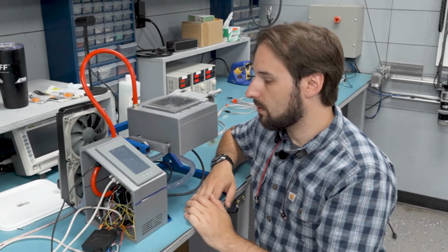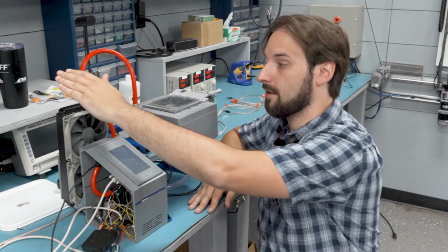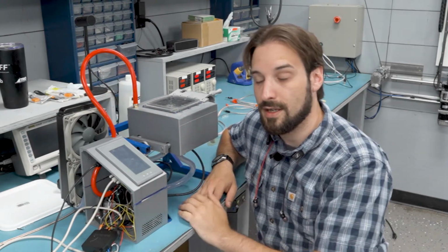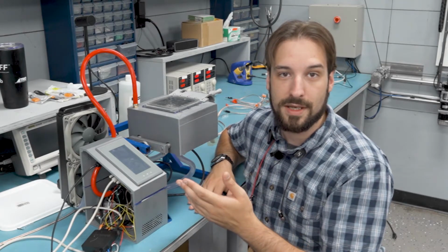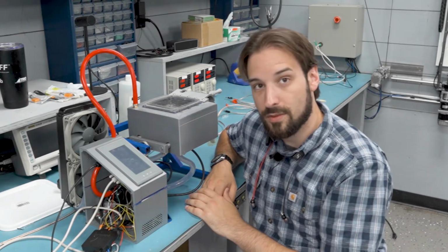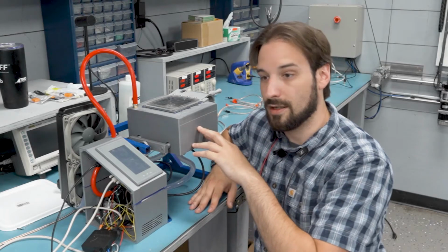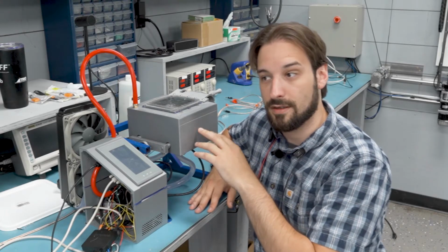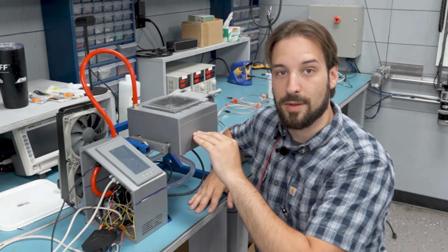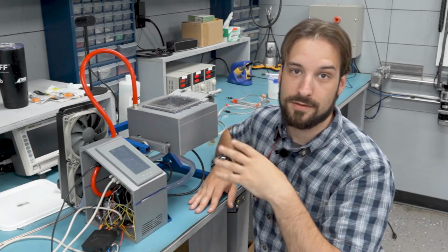So I have this wired up so that as soon as system power is applied, the fans on the radiator as well as the circulation pump back here that you can't see turn on. So they're just going to always be on if the system's on at all. And that's both easier to wire and also a bit safer because it's just always going to be cooling the Peltier devices in here. So I don't want to end up in a situation where I've got the heat pumps on, but they're not being cooled because they can just come up to temperature and destroy themselves very quickly.